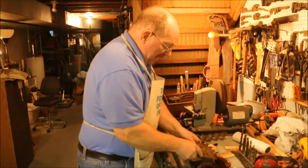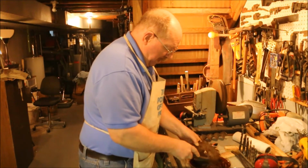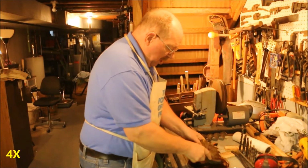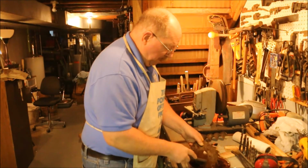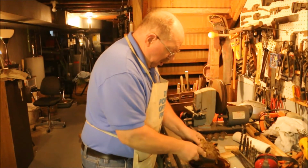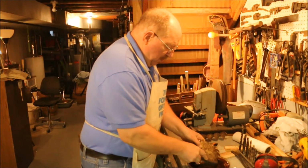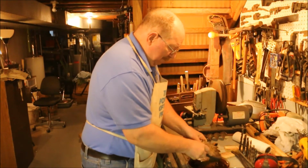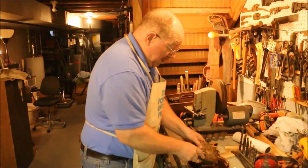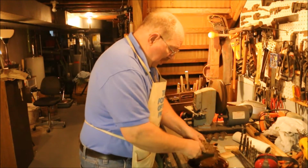After soaking about 8 hours in vinegar, the rust on this blade is coming off pretty quickly. This is just a little brass wire brush. I don't like to use steel brushes on carbide because even though carbide is incredibly hard, it is brittle, and you can chip the edges.